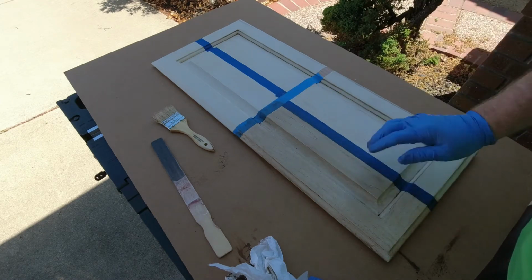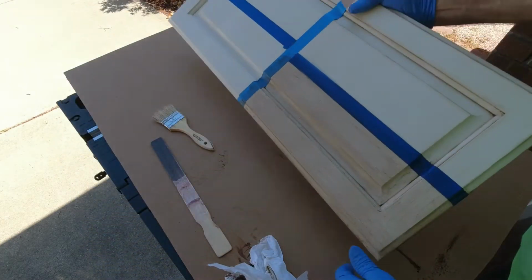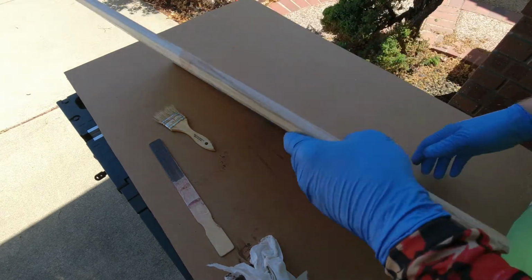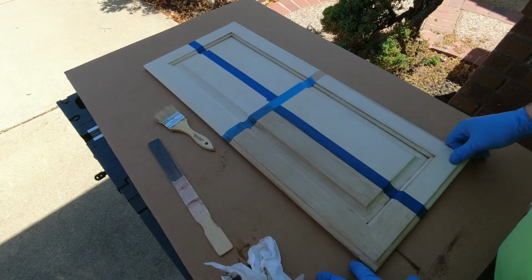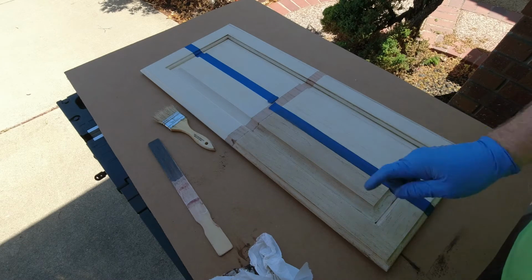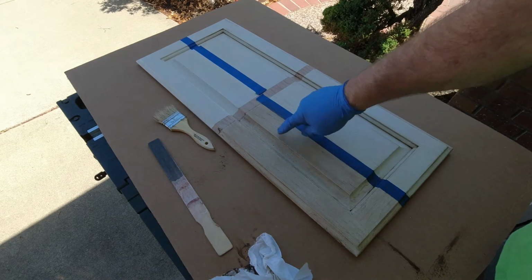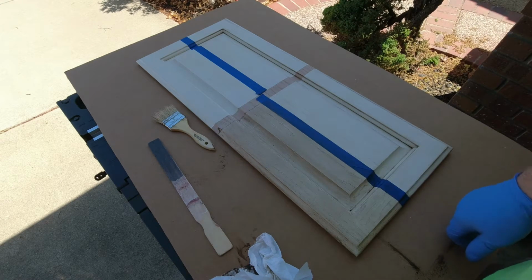So there's paint here, and again, part of the process was to eliminate or reduce the grain as much as possible. And now with the ceruse, I'm actually trying to pull the grain out. So I think what we will do is ceruse this side. I think you'll see another video in the near future from me on cerusing, because I'm not going to make that any darker than it already is. So what I'm looking for is a better effect of the actual grain two-toning. So that's it for this weekend's light time video of a totally different topic, nothing even remotely related to reloading.